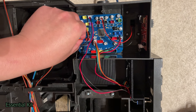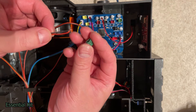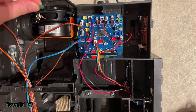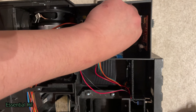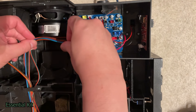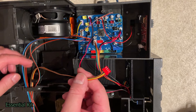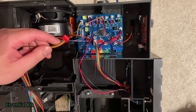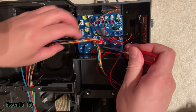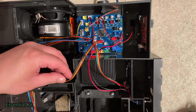The two-pin red one is the alarm switch and goes right here. The blue one for the inner cyclotron panel switches goes right next to it on the blue connector. The green one is for vibration — that goes right over here. For the red cyclotron lid wire, that goes right behind the white connector here. Do not mix it up with the red one down below. Set that remaining wire aside down there for now.